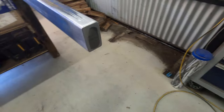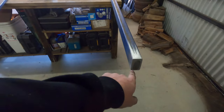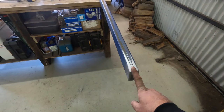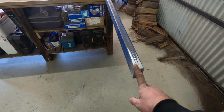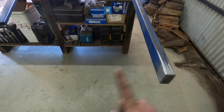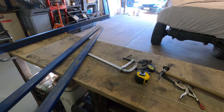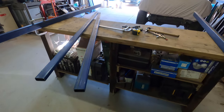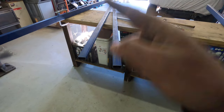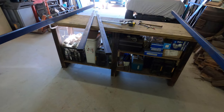The reason I've finished these off now is because once the cross beam goes in I can't get in there to properly clean and sand. Think ahead — clean up stuff you can do now instead of trying to do it later. I've already got that piece clamped. I'll sit the spacers in there to set my width, shuffle them back and forth to get my diagonals square, then clamp the back and front bits of tube.